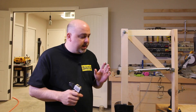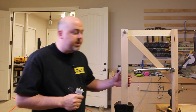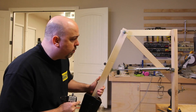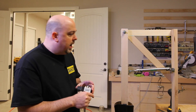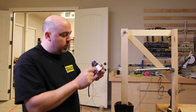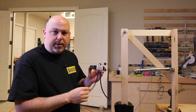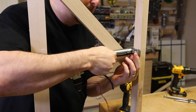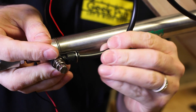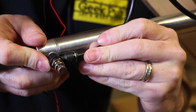The automated butt kicker is powered by a pneumatic piston. That pneumatic piston has two air inlets — one drives the piston forward and one drives it backward — and that is controlled by this pneumatic relay, which reverses the airflow. It has one input and two outputs, and supplying power reverses the polarity. These fittings are similar to PEX fittings — no glue or leak-resistant tape required.